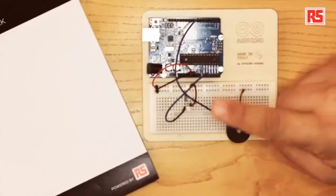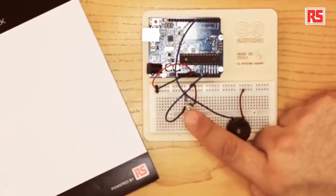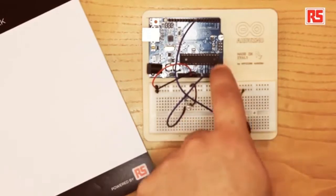Here we have a piezo buzzer. The piezo buzzer produces sounds every time it's turned on and off, and it's connected with a wire to pin number 8. And here we have a light sensor connected to analog input 0. The light sensor detects the amount of light hitting its surface. By moving the hand near or away from the sensor, we reduce or increase the amount of light, and in turn this information goes into the Arduino as a variation in voltage. In our code, we're going to use the variation of voltage to gauge the distance of the player's hand from the sensor, map that to appropriate sound values, and drive the piezo capsule using the tone function.